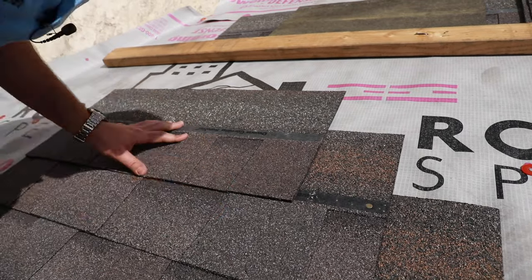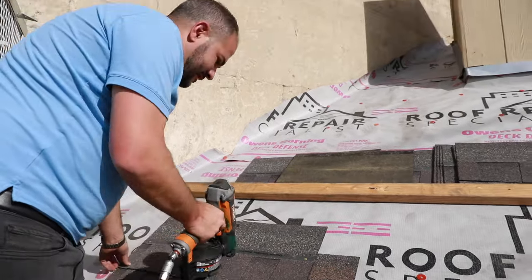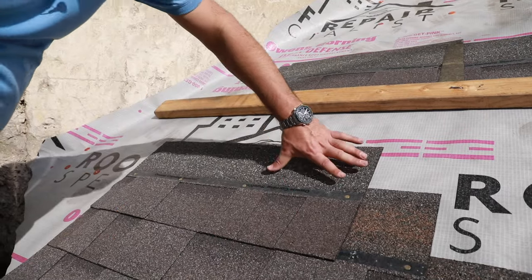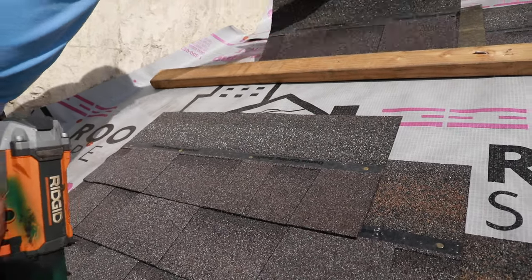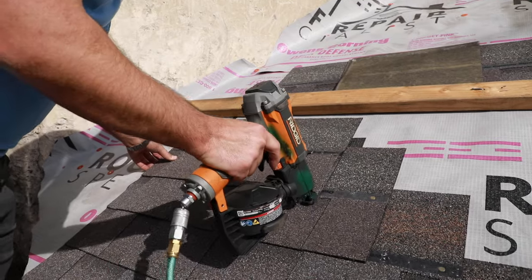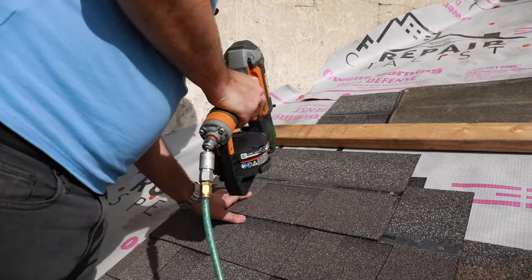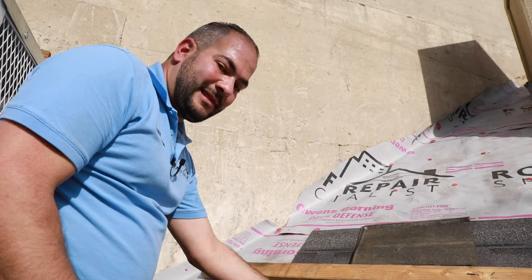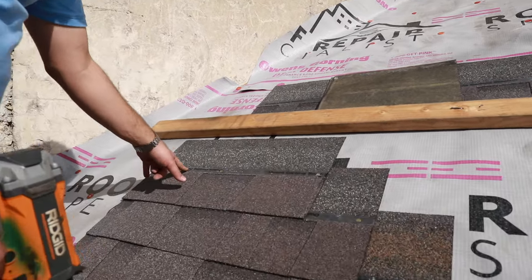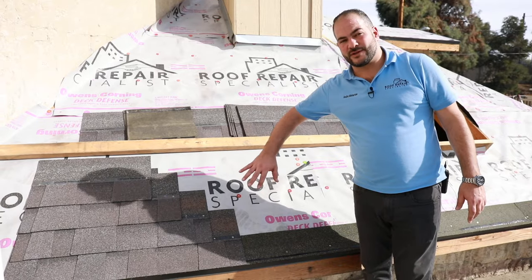We've cut the shingle six inches in from each side — the cut end is on the inside. We're going to align these shingles: one inch from each side, then two nails placed about 12 inches in. That placement is really the most important — you want to have 12 inches for your next shingle. On shingles less than 24 inches, place one at each end and one in the middle, ensuring no more than 12-inch spacing between nails. We've got 12 inches here and 12 inches here, so no need for a third nail.